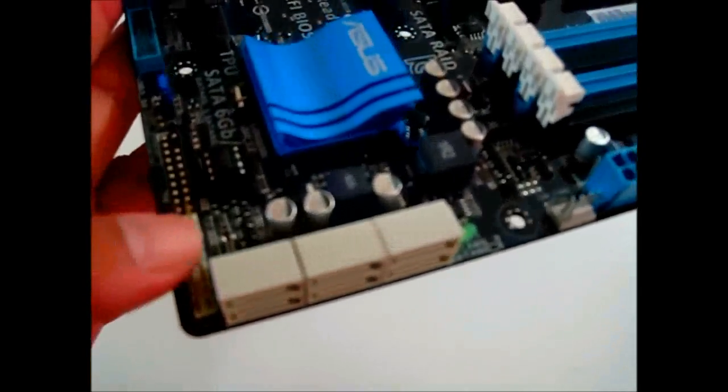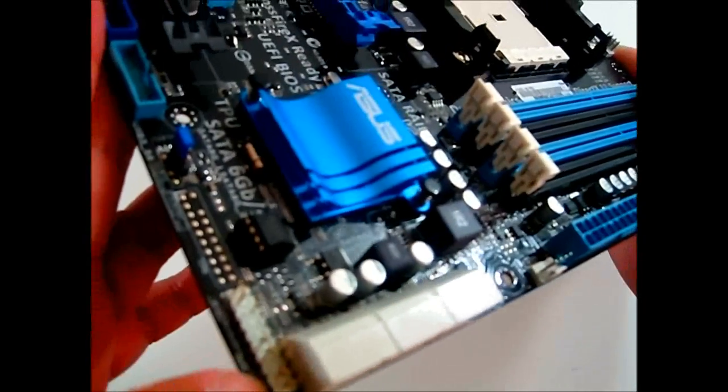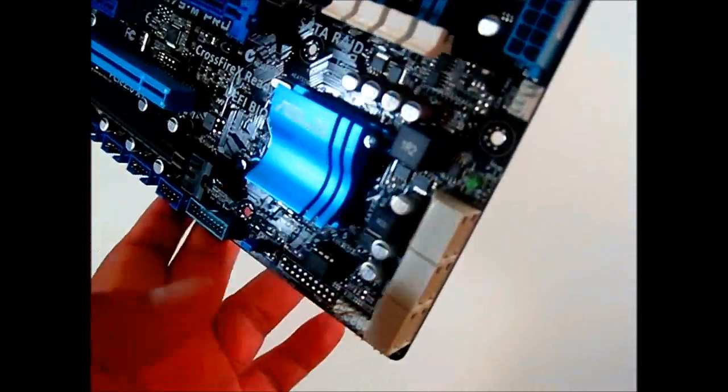You can see a power LED on board and six SATA 6Gbps ports at 90-degree angles for convenience, along with your front panel connectors. The SATA6 is natively supported by the Hudson D3 A75 chipset found underneath the heatsink. The chipset doesn't require too much cooling because this is the FM1 socket which supports the A-series APUs.